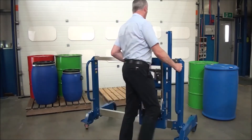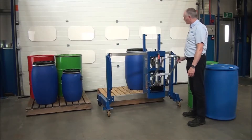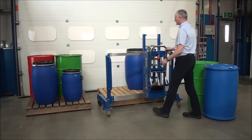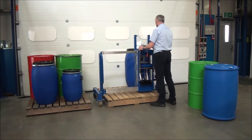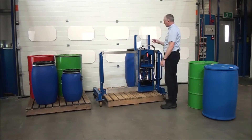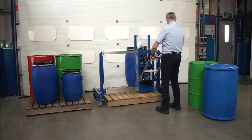We manoeuvre the back, go over the pallet again, and pump the handle to bring the catch back up to the top. It's a very tall Mauser, so we manoeuvre in, then side shift across to the centre of the drum and lock. The catch has now gone round the drum. We watch through the guard as we pick it up, and then manoeuvre away.